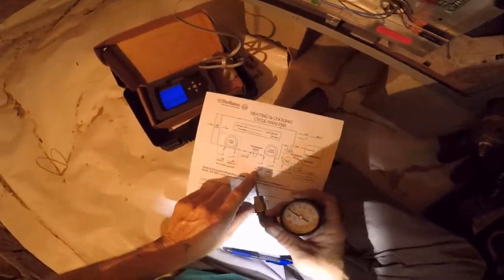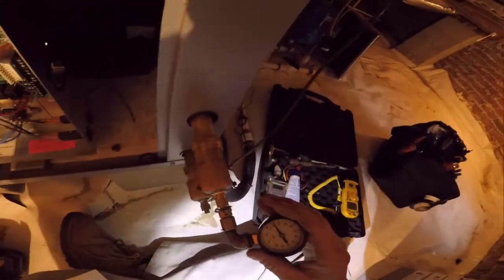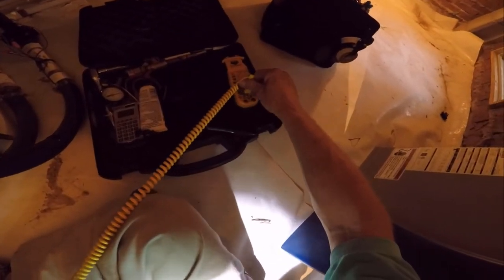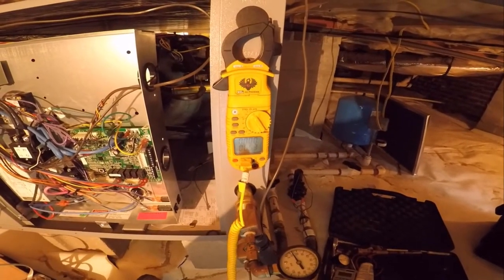We'll get our water pressure drop. We'll let it run a few minutes before we get temperatures. We want water in, water out — brine in, brine out. To get our pressure drop, we'll consult the manual app on my phone. It looks like we've got 16 PSI going in, 13 going out — so a 3 PSI pressure drop. Entering water temperature is 65 degrees. Since it's an open loop, it's coming directly out of the ground and dumping back into the creek bed a few hundred feet down the hill.